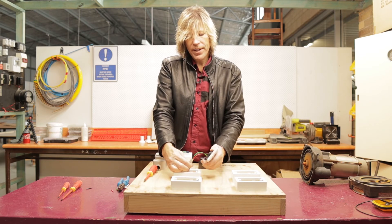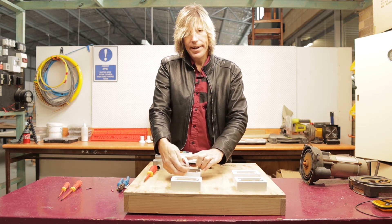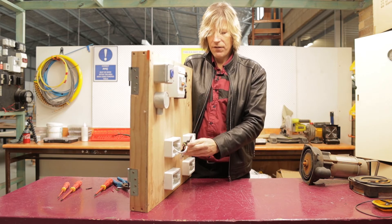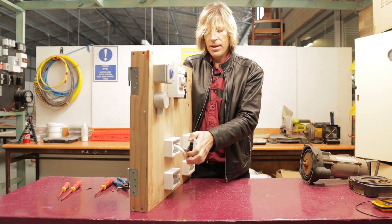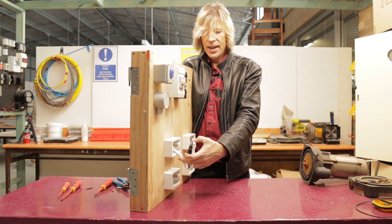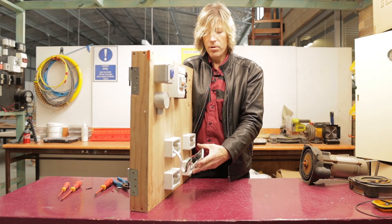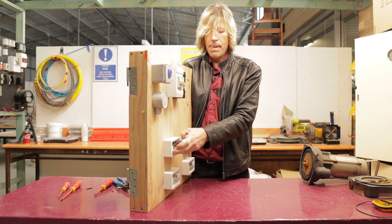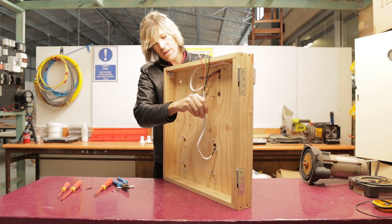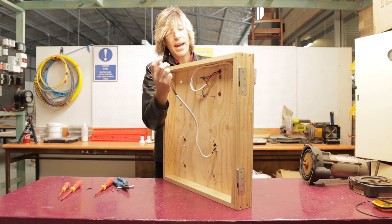The other thing to be mindful of is you should always leave a little bit of slack cable, especially in a wall cavity. In a wall cavity, you should actually loop it down. If I put my cable into a wall, I should be looping my cable down like that. The reason we do that is because if water gets into that wall cavity and lands on the cable, it is going to run down and drip off the bottom — it is not going to go into the back of the GPO and cause problems. So when I tuck that into the wall, it would look something like that, with a dip going downwards and the cable going up to the GPO. So this other end can now go into my RCD and into my earth point.